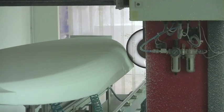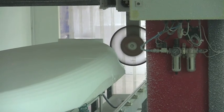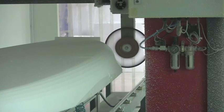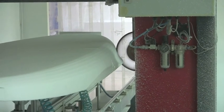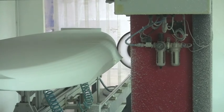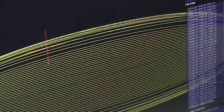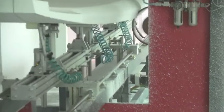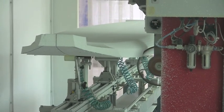Symmetry is important and it's very difficult to achieve with hand shaping. When I was a kid I used to hand shape some boards in my parents' basement with mixed results. Obviously if you screw something up on a foam blank by hand you can't just add foam back to it. On a computer the nice thing is you can sit there for hours and refine that shape, make small changes, keep changing until you get it just right, and then you send it to the shaping machine which makes a perfect replica of that design.